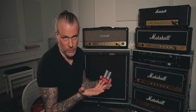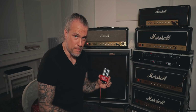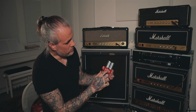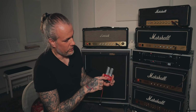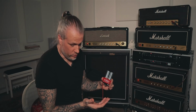And the gain switch, it has two positions. Down, it's the original MOD V2 gain boost, and up, it boosts a little bit more gain, more compression, and adds a tiny bit of low end. So I had it on the upper position, but then I compensated the low end boost by having the bass switch down, which cuts the boost, because I liked how this compresses the sound.